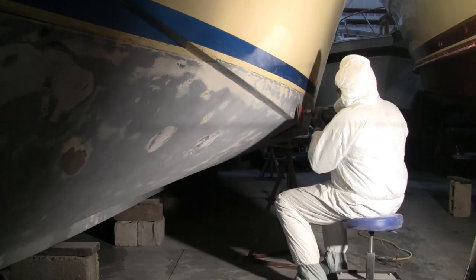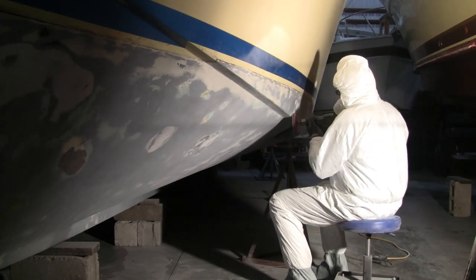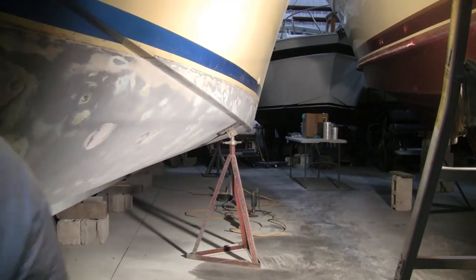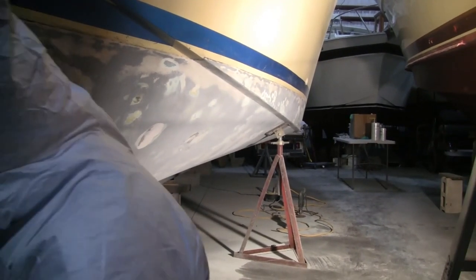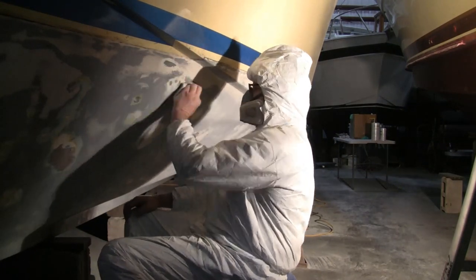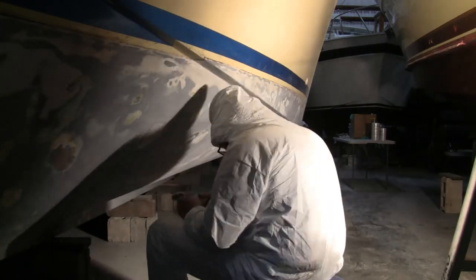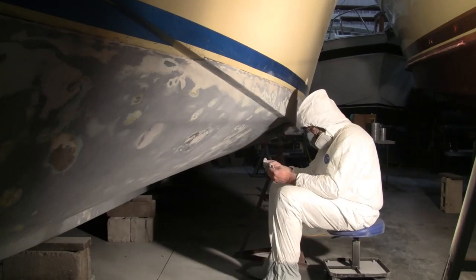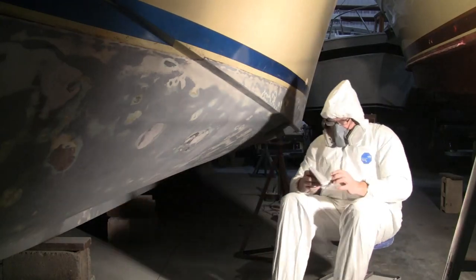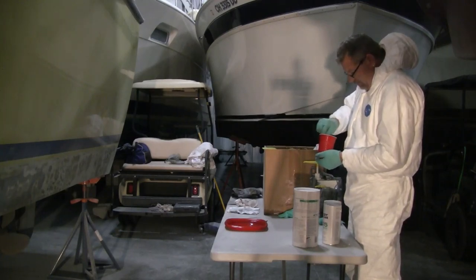From that point, you look at the areas that need repaired. I go into them with a disc sander — it sands a nice bevel. You can get right down through the gel coat, right into the original glass. When you need to make a deeper repair into a blister or something like that, you've got to get down deep into it. Remove all of the damaged area and leave a nice beveled area for your repair to stick to, so it kind of spreads out over a surface. We went over with a fine tooth comb looking at the bottom and sanded into the areas that needed repair. Now we're just wiping the bottom down with acetone, which cleans off all the dust, any wax materials, and anything that's going to cause your epoxy not to stick. I use acetone on a rag and wipe it pretty heavy, and we actually go through this process several times — done almost between every step when you're putting epoxy on, to make sure you've got a clean surface.